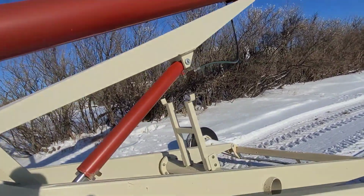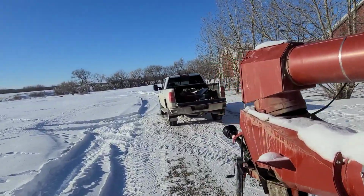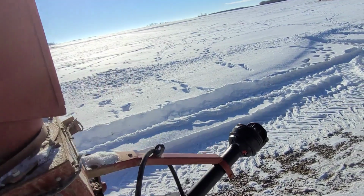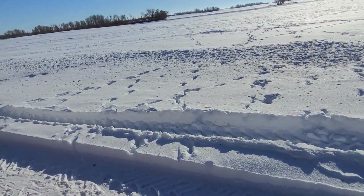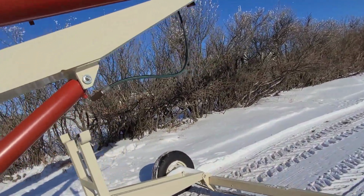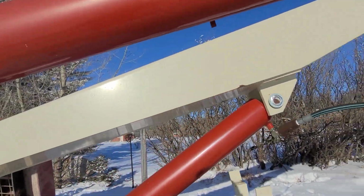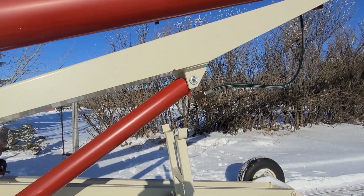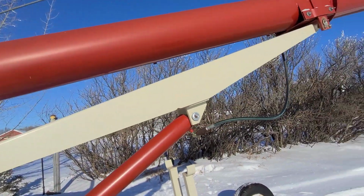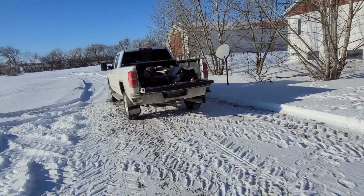Not necessarily very good. What do I think is happening? Well, there's a valve here, and there's a valve here, and technically that's a valve to the fitting, is a check valve if you want to look at it that way. One of those, I believe, is getting blocked by some form of debris. Now, which one? This is actually a needle valve, or a throttling valve, and that's used to control how fast up and down that thing's going to go. So that's where I'm going to start, is that it's never been adjusted. It may have just failed, or something's fouled it up. That's my suspicion on what's gone wrong, but I'm going to troubleshoot from the tractor forward or backwards, however you want to look at it.